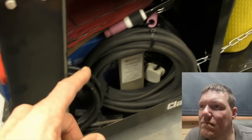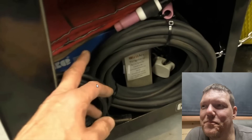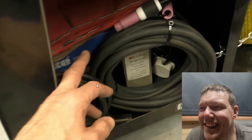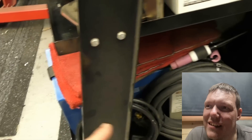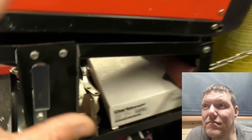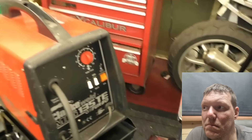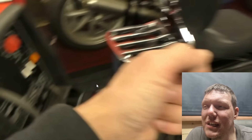I'm going to keep that as an arc welder because I can do outdoor welding - I want to make some railings for the house so that might be a useful tool. MIG outdoors - it's better to do stick welding if you can. That's also got the TIG head for it, you can use these inverters as a scratch TIG welder. I've got all the stuff for that and I will be learning some TIG welding in the future.